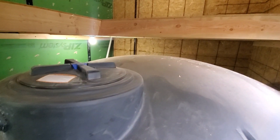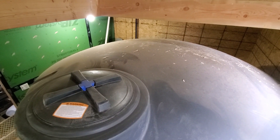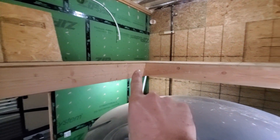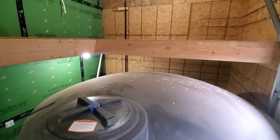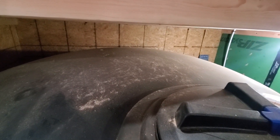I decided to jump over to the water tanks, pull them out, and figure out how I'm going to get them set. My idea right now is to drill a hole right in the very dead center of the top. The pipe will come over, down into the floor, and then drop right into the top. I'm not going to do a first flush — I've heard too much about them being a waste. There's a little divot right in the center, so I'll mark my circle there and that's where I'll put my pipe in.